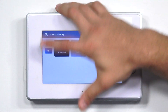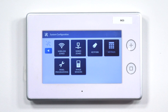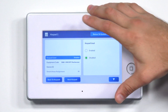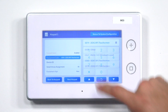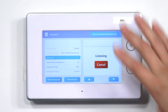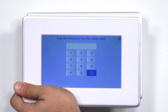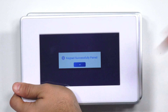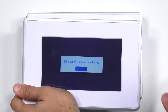So on our GC3, I'm going to click the back arrow and then go to System Configuration. I'm going to click on Keypads, then click on the menu on the right-hand side to get into our edit. I'm going to set Keypad Used to yes, Equipment Code — I'm going to click the hamburger button and select the SP2. Then for Device ID, SP2 is not connected, so I'm going to click Pair. Now the system is listening for the SP2. I'm going to click the check mark on this menu. It says enter the pairing key from the master panel. I'm going to click Check, and it says the keypad has successfully paired. Just click the check mark and you'll get right through it.